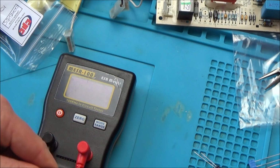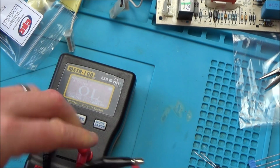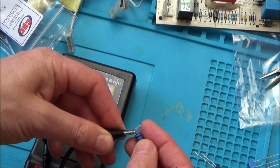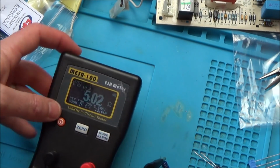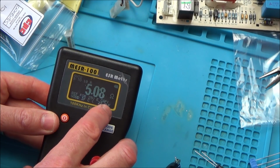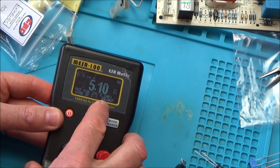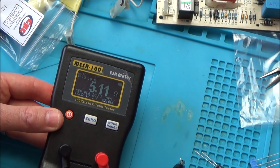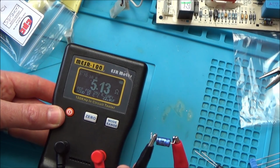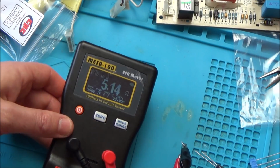Oh, hold on, sorry. Zero it, one second. Okay, let's see what this thing reads. Right, so it says, reference for a 25 volt electrolytic cap, good if capacitance is less than, that's less than, isn't it? Less than 22 UF. Okay, but it is 22 UF, so maybe... Because I think when capacitors fail sometimes, they can act like a resistor. It's not 25 volt either. Okay, 63. No, okay. Well, let's go down here then.